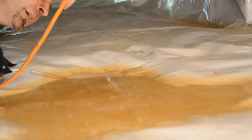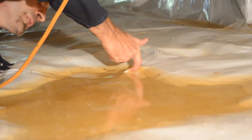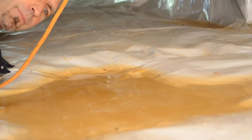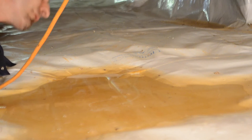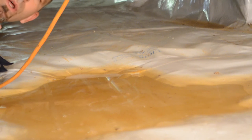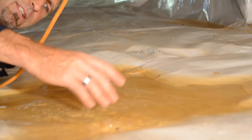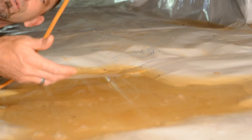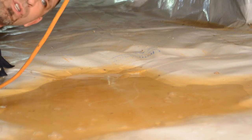The system that was installed was not able to divert the water over to the sump pump. We had pressure against the tape here, and this tape seam is no longer sticky at all - it's been sitting in water far too long. The adhesive has failed once it came in contact with moisture. There are failed spots all over. The tape you could get from crawlspacerepair.com won't fail when it comes in contact with water.